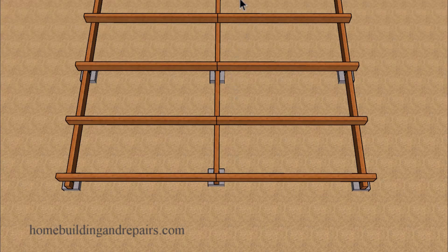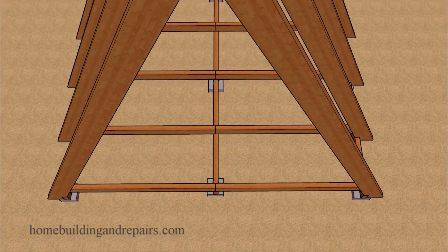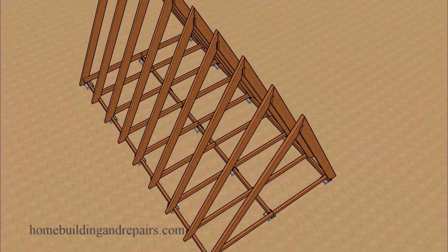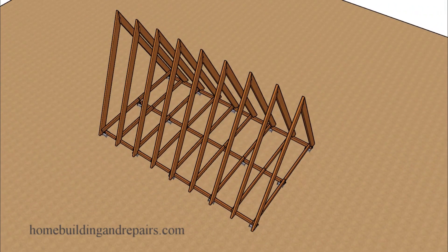Next up let's add the roof rafters. This design will have blocks in between the rafters and a beam underneath them. The beam really isn't going to be a supporting beam — we don't need a ridge beam for this design. However, we are going to add some support posts underneath the beam to make this building a little stronger.